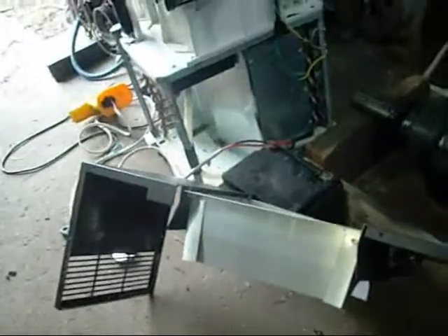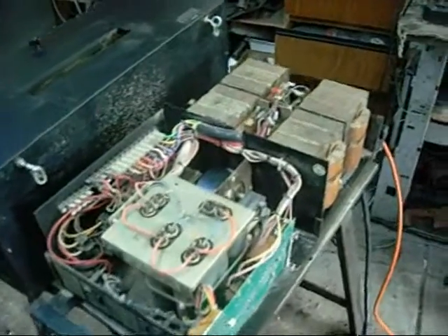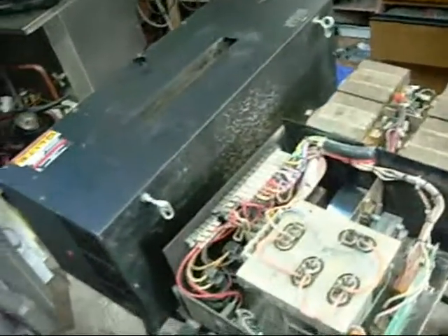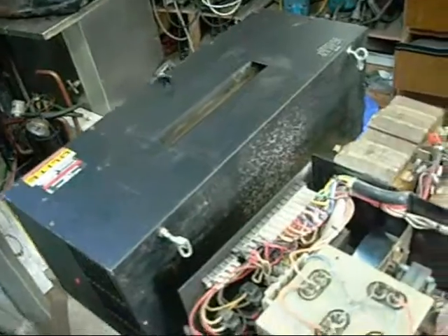This thing must obviously run manually off a push button or a pedal. I'll give this part a clean up and apply some power to see what really happens. The system is working but it's a bit out of sync - it will illuminate the light when the fans are off and the shutter is closed, but when I open the shutter it turns the lamp off and turns the fan on.